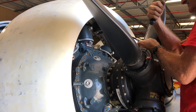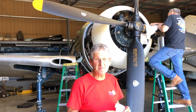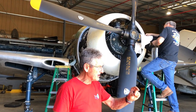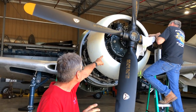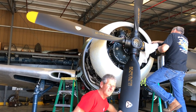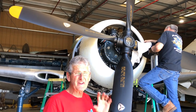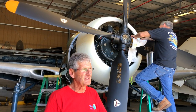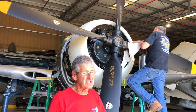The Bearcat has what's called an Aeroproducts propeller — a fully constant-speed propeller controlled by its own reservoir of hydraulic fluid, with a pump inside. There's a stationary part on the engine, and as the prop turns, the stationary parts run gears in the back of the propeller. What you see Kevin filling up is a big reservoir in the back of the propeller. The prop is hollow steel, 12-foot 7-inch diameter. Aeroproducts props are really fast-acting when you cycle them and very steady on RPM in flight. It's also a lightweight propeller compared to Hamilton Standard — that's one reason it's on the Bearcat, because it's all about the weight.